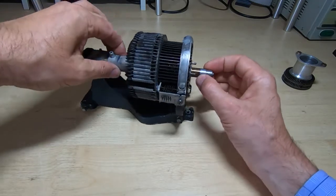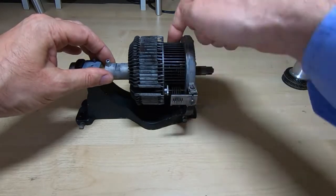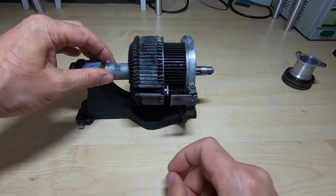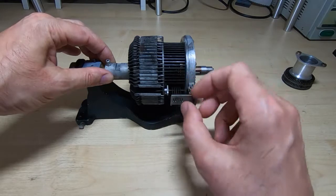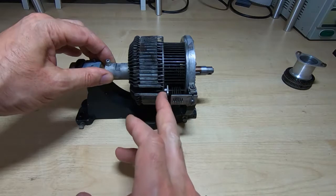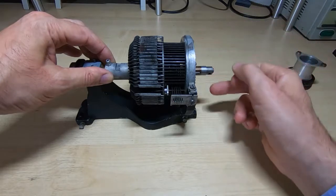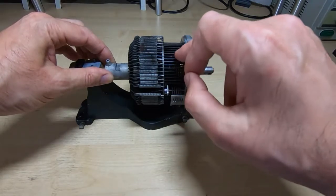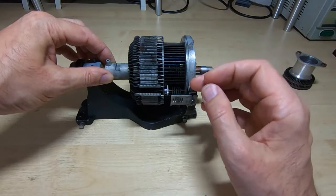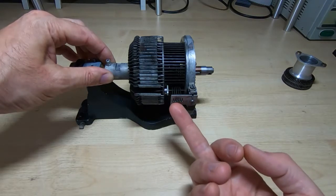And the reason this is necessary is as these levers are moved, each of these levers is spring loaded and it's constantly trying to push down into the spaces that are encoded into the discs that these levers attach to. So there's a series of 5 discs, actually there's 6 because there is a second character set, but if we ignore the last one for now, there are 5 discs. Each of the discs has slots on its periphery, and the slots on each disc are arranged so that they represent unique codes for each of the possible combinations of these levers.